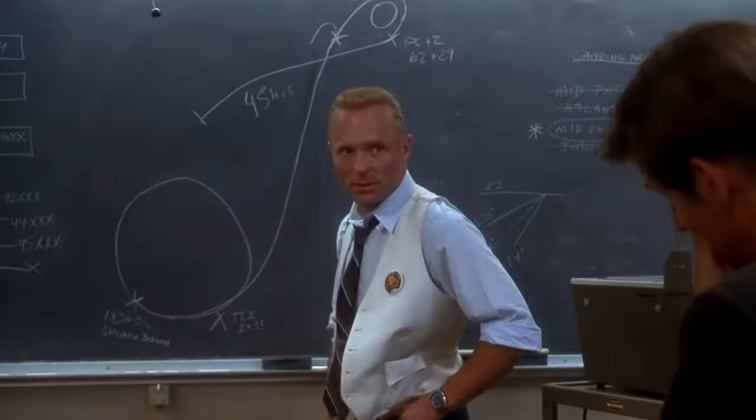The video transmitter does come locked, and I had a few issues with it going into pit mode randomly. Pit mode is like transmitting 1 milliwatt. So it looks fine when it's right next to you, but as soon as you get about 10 or 15 feet away, the picture totally goes out and you just kind of fall out of the air. That's a special note, anybody, anytime you're flying a new piece of equipment that you've built or bought. That's not acceptable.